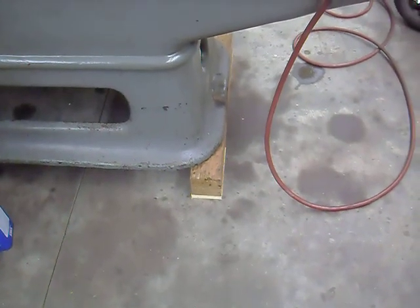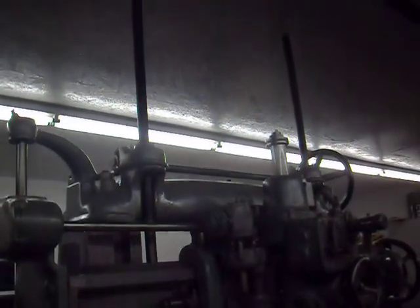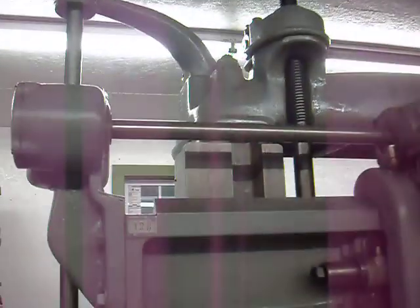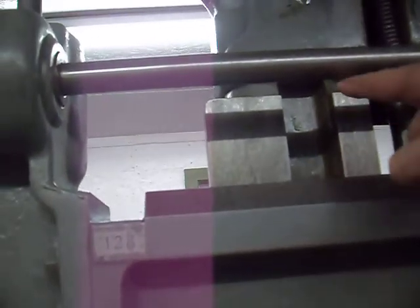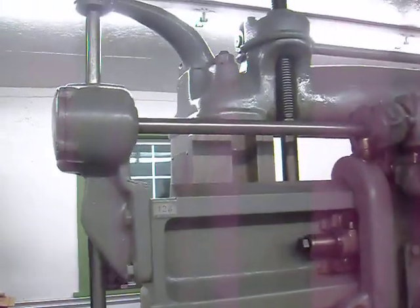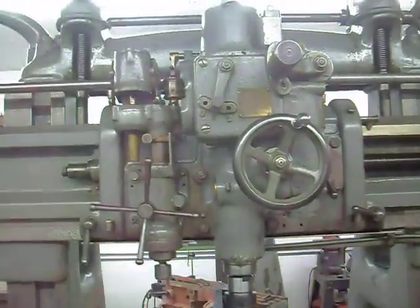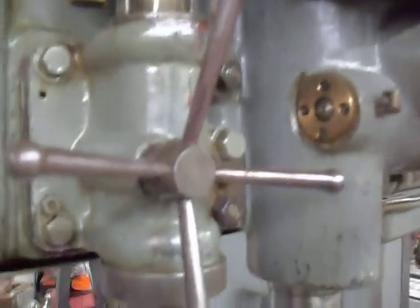Oh, this is interesting. So I've got it down on the floor and I got it under 4x4s so I could move it around with my pallet jack. But anyways, I found out the elevation screws for the Z-axis are hitting the ceiling. Sorry if the light's blowing it out. You can see this. I can go another like 4 inches. So if I drop my machine off the 4x4s, I can get another 4 inches of vertical travel, and then my lead screws won't hit the ceiling. But this is such a cool machine.